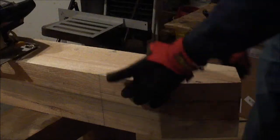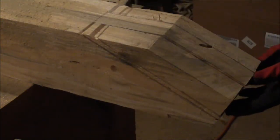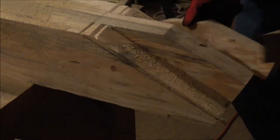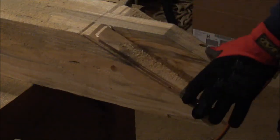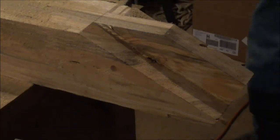I've made my cuts. I curved down this side three times and the same on the other side. I was able to leave the saw at the same depth because I had cut back far enough that it would take out both blocks. Now I just have chips here to knock out and pull out, and then I can trim it up with a chisel. First though, I'm going to do the same as I did the other day.